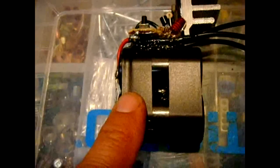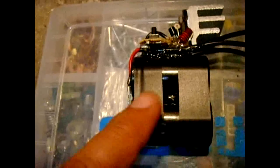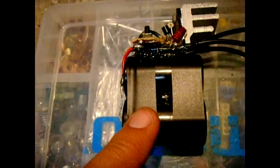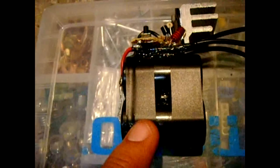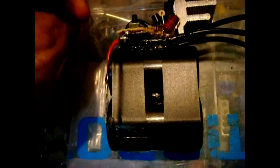You can see the power feed right here has a Schottky diode, so the current will flow in. Now the circuit only draws 6 milliamps, which is nothing. The current flows in through here, it can't go backwards. It'll charge these capacitors. And what's going to happen is if the circuit experiences a heavy load and draws the voltage down, these capacitors will act like a reserve on the voltage. It'll keep it up for about 3 seconds while that load goes all the way down and back up again. Without these, the circuit will open up and then you'll disconnect.